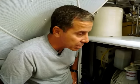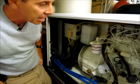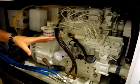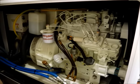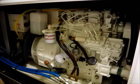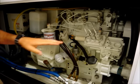One of the more common challenges that you might face with a diesel-powered vessel and a diesel generator like the one we have here is bleeding air out of the fuel system. For conventional generators and engines that use mechanical fuel injection rather than electronic, getting that air out of the system is something you have to do manually. The best thing to do is to avoid air getting in there to begin with.